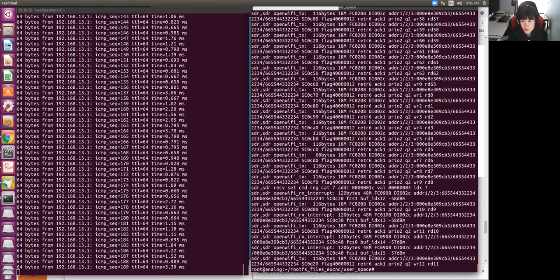You see now you not only get prints from openwifi_tx, but you also see the openwifi_rx_interrupt. This is basically the interrupt service routine that's called when you receive packets. You see a certain modulation coding scheme again being used, the packet length, the signal strength with which you received the packet, again the addresses, and also whether it has passed the checksum. In this case, the FCS is 1, which means it's a valid packet. But in this other packet, the decoding has failed, so the FCS did not pass. So it won't be acknowledged.